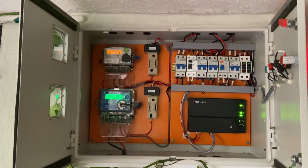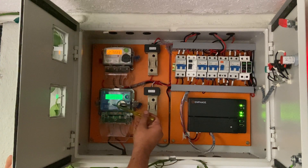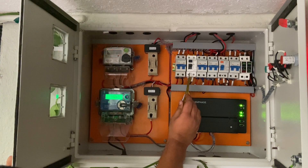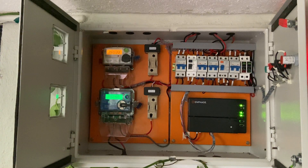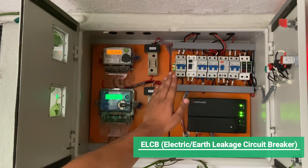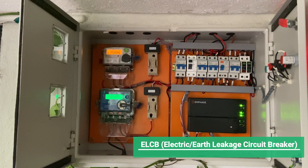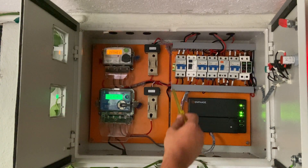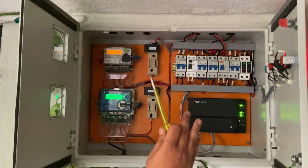The power from our power utility grid comes into this meter, then goes through a fuse rated for 20 amperes, and from here it goes into the ELCB. The ELCB is very important for any kind of load. Here we have a 25 amp ELCB with a residual current of 30 milliamperes. This means if there is 30 milliamperes of residual current flowing through any metal enclosure, it will trip and the entire system will switch off including our solar. Since solar is connected to the grid, if the grid is off, solar also gets off. If this trips, both solar and the house are isolated from the incoming power.